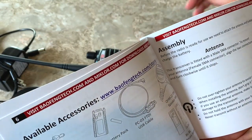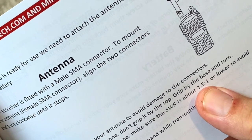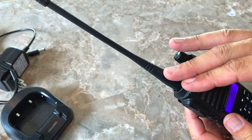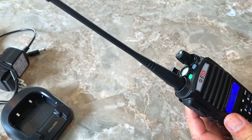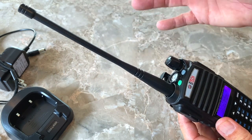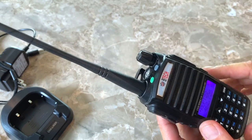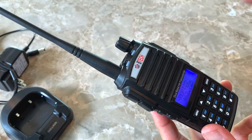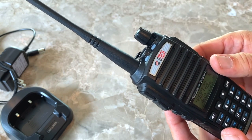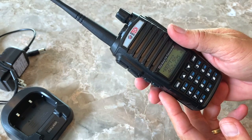The manual says right on page 7 that when connecting an antenna, make sure the SWR is 1.5 or less to avoid damage to the receiver. If you have a high SWR, that means your power, instead of going out and being transmitted, is bouncing back into the radio. The antenna is not working well, your range may be limited, and that reflected power can cause the internals to heat up and get damaged over time. An extremely high SWR could cause quick damage. BTEC says don't use an antenna with an SWR higher than 1.5.